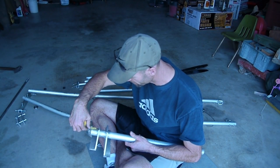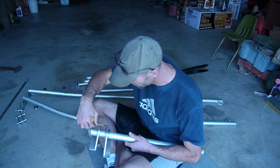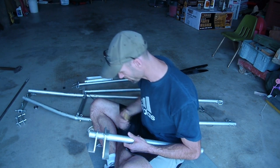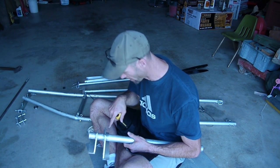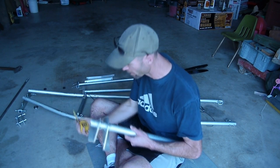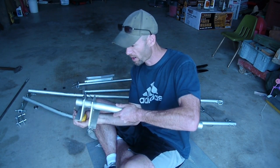So it's an inch and a half down, inch and five-eighths part, and this is for the motor mount. So I would drill a bolt hole here, and here, and here to mount the engine on the bottom of this.